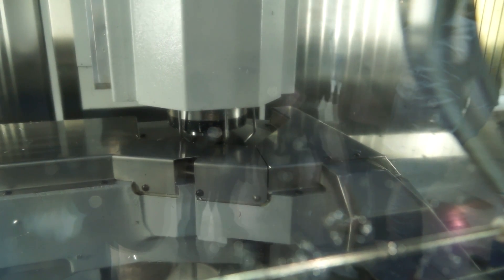Is one of these axes driven — is it one end and one is a support? On the very shortest trunnion assemblies, that can be done that way, but typically we put drivers on both ends, especially when the work bed gets longer, because this is actually a two meter machine and we go all the way up to six meter machines. So this is a two meter — does it rotate through 360 degrees on that axis? Yes, it does. Both 360 degrees on the rotating A axis, and on the B axis we actually rotate plus or minus 110 degrees.